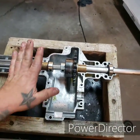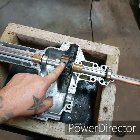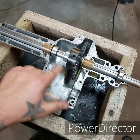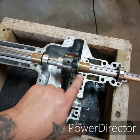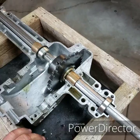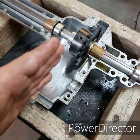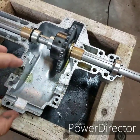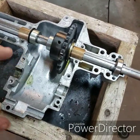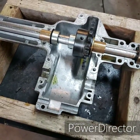For the first half of this assembly, we have our axle shaft all together. We have our sprocket set in the keyway and locked on, our two shaft locks inside with brass bushings set in on both sides, and thrust washers on both sides along with our bearings. On this side we do have a couple more thrust washers — you might have to take it apart a couple times to change the amount in order to line up with the front sprocket. The front assembly will have the bevel gear, which has to line up perfectly with your input shaft, so you might have to add or remove shims to get those lined up.